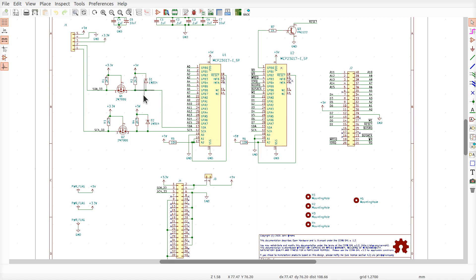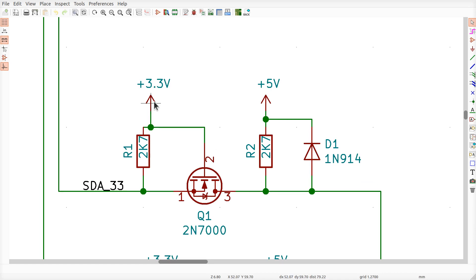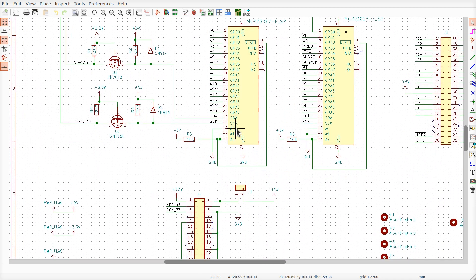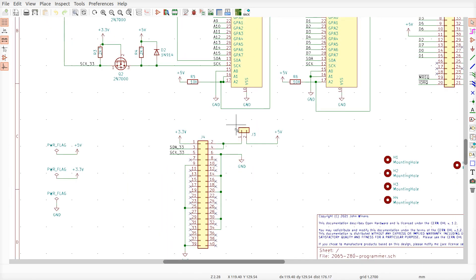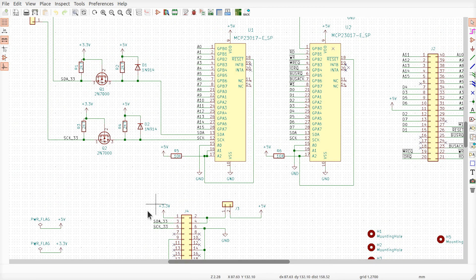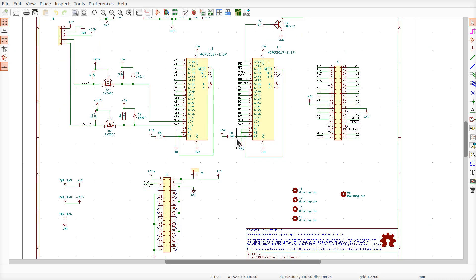This situation also can't occur if both the Pi and Z80 are powered up simultaneously, or if they both shut off simultaneously. That's why the diodes are optional. The recommended usage is: put J3 in, power the Pi only, and let the entire Z80 retro board be a peripheral of your Raspberry Pi. Run the flash app and it'll program your flash ROM.